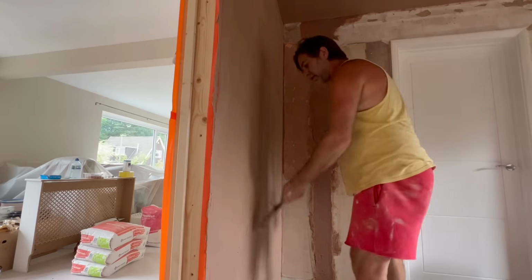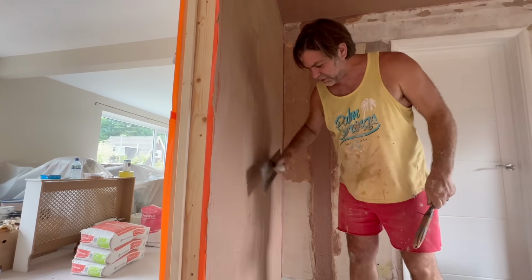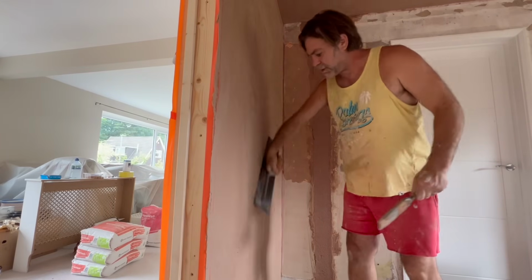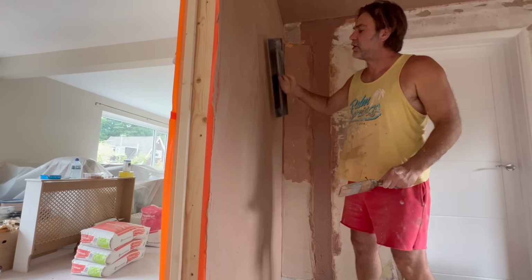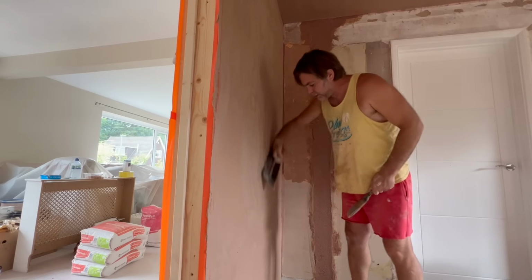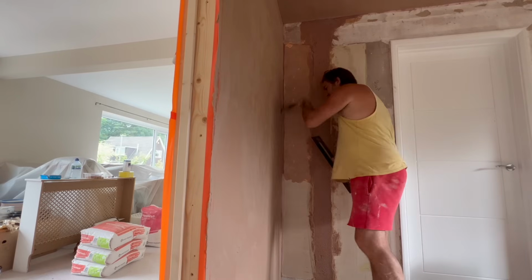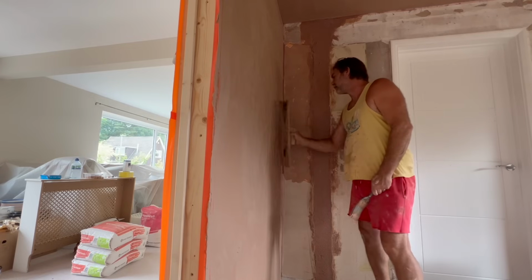Okay, so just demonstrating that with your wet brush, kind of opening up the trowel, getting a little bit of sludge out there, considering this is the first time we're bringing a wet brush into the situation. We can use the kind of, if you like, the fat out of it, we can use that to push that back into the wall. Only at this stage though. As we get a little bit further down, you can't use that stuff anymore because it gets too thin and it's too weak. But I'm going to just keep up with this.